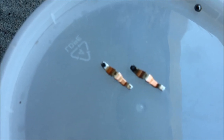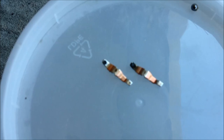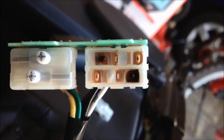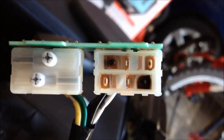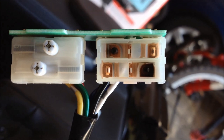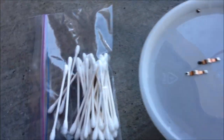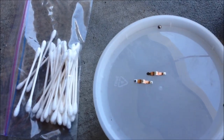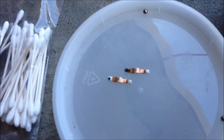I'm going to take a pencil eraser and try to clean that charcoal off — I might need a small file, but I'm not going to try to file it until after I clean it. On the other end, I'm going to use a Q-tip with some alcohol or contact cleaner to see if I can get that charcoal to come out. Here I have my can of contact cleaner, my dirty contact, and my bag of Q-tips. I'm going to put some cleaner on the Q-tip and then try to wipe all that charcoal off.